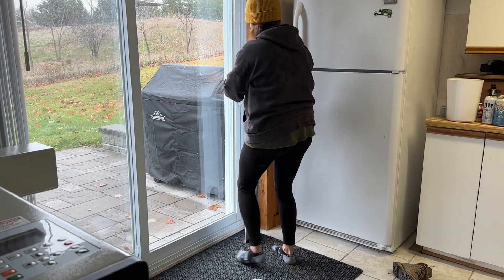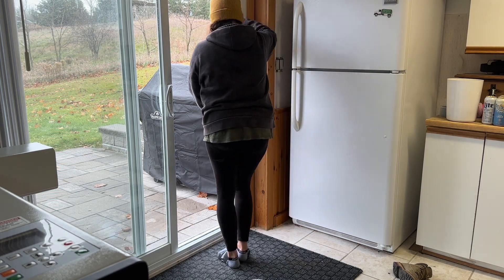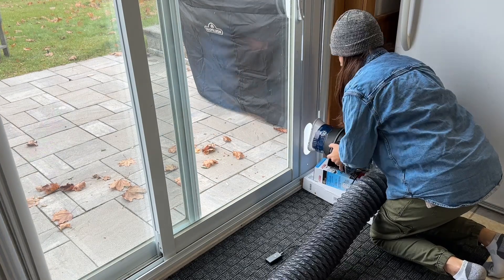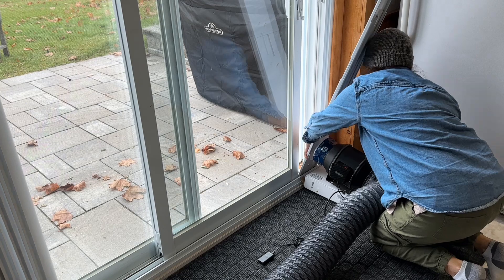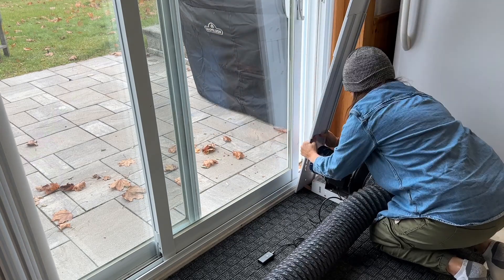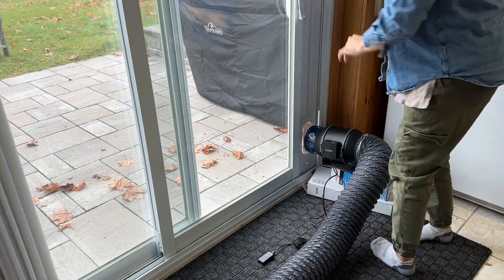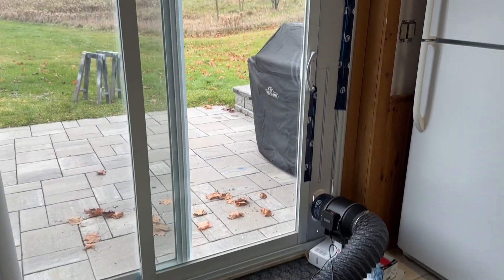I decided to go with a door vent to have it vent outside. I have a sliding door next to my laser, and this vent — I got it off Amazon — it simply slots into the rails of your sliding door, and then you are able to fit the end of the laser hose into the base where there is the vent. I used tuck tape to tape it to the fan; it worked out really well because everything was the same size — a six-inch diameter fan and a six-inch diameter part that vents to the outdoors. Once this is set up, I do use the blue tuck tape to cover all of the seams — top to bottom — so no vapor gets inside. It works great.